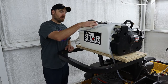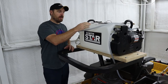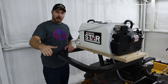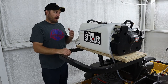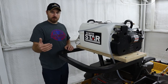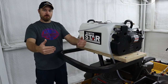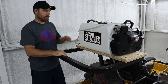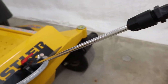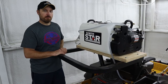Normally you would have a bracket that bolted onto the back of this tank — if you were mounting it on the back of an ATV, the boomless sprayer would hang off the back and spray behind you. But the way I ran my old machine, I had the boom mounted up front so I could see what I was spraying. It's very nice to just drive forward and watch the spray in front of you and see exactly where you're spraying. So I made a simple bracket bolted to the front of the mower to mount the boomless sprayer up front.